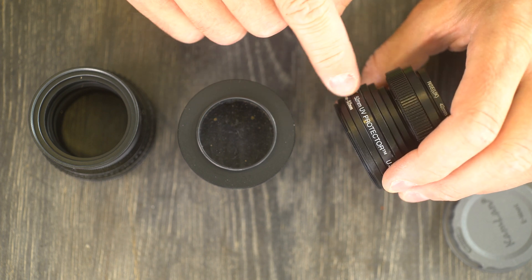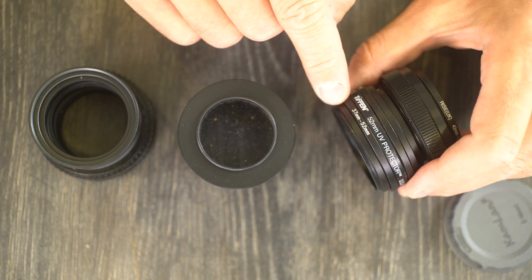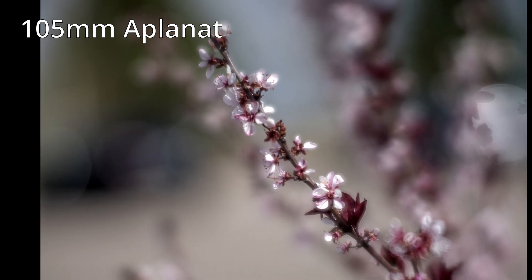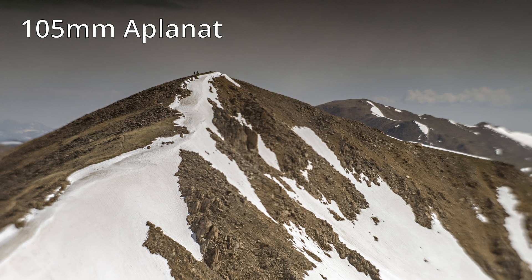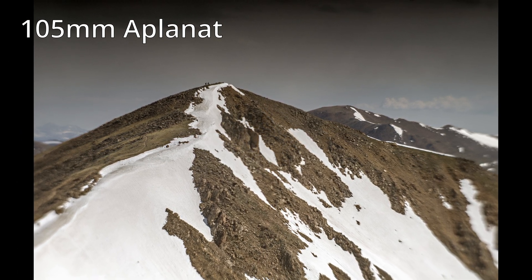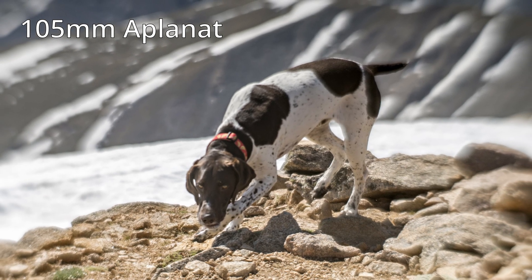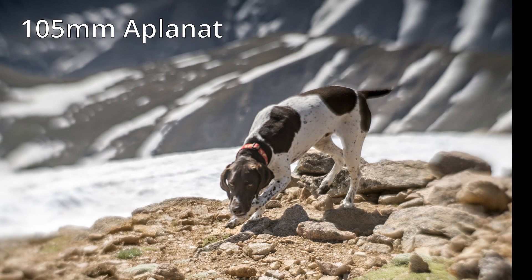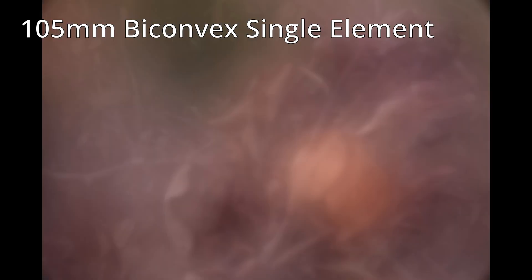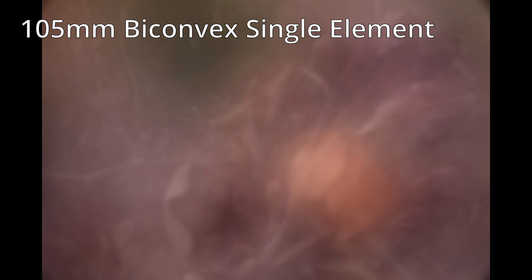Next up, get an array of step-up and step-down rings. Make sure you have some with M42 threads. These rings will allow you to make a small housing for your lens. You can take a couple of rings — a step-up and a step-down ring — put a lens in between them, and then just screw them together, and now you can put your lens into your system. This assumes you're starting off with a very simple single glass element construction. Those step-up and step-down rings can help you create some small adjustments in the housing that you make, meaning you're likely to be able to get closer to infinity focus. As you get better, you can add multiple elements to the system and experiment with how they work. You'll need more step-rings and more elements for that. It's fun to do that, but get the hang of building lenses with a single element system first.